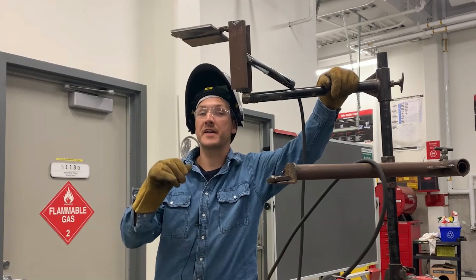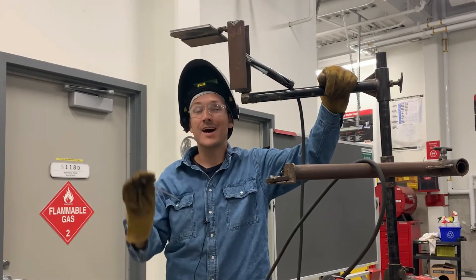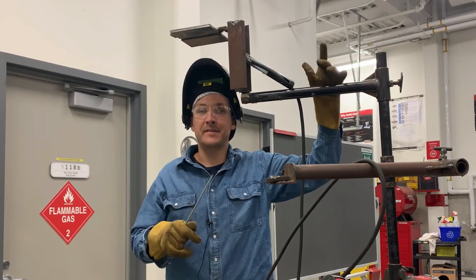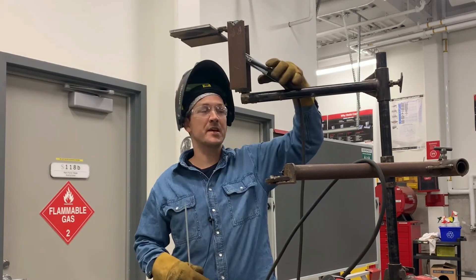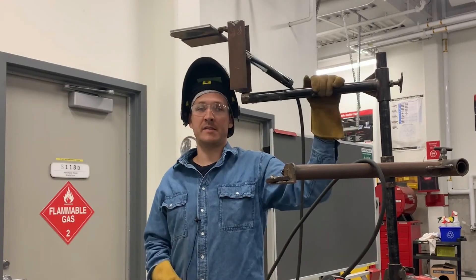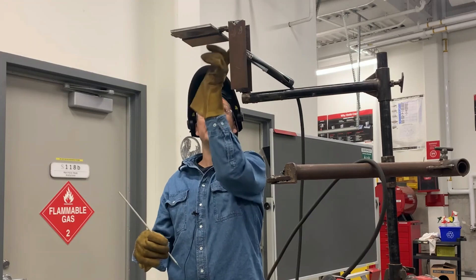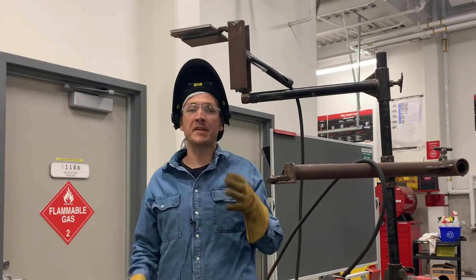I'm going to tie into that first stop on the square side — you can see me striking ahead a little bit, coming back to the crater, tracing it, and then moving back to my regular travel speed. This all happens pretty quick so make sure we're using a fresh rod and we're prepared. Here's the finished product: I've got both root passes in with the tie-ins and there's enough room in the middle for that center pass. With those tie-ins done, it's time for the third pass down the middle. I just got a bunch of arc blow on my last tie-in, so I'm going to adjust — I moved my ground and relocated it to get a better work lead connection.